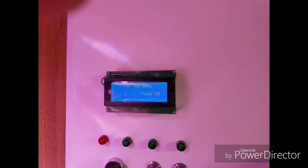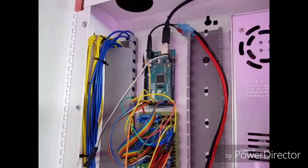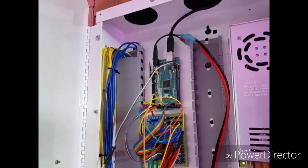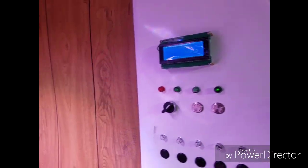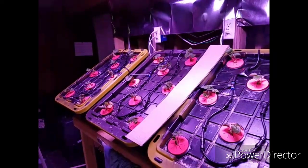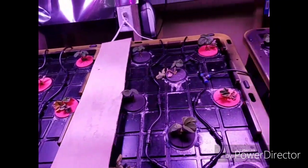Yesterday I had to rearrange this a little bit. I took all the sensors off and I'm going to do a different setup using a few ESP8266s to get all the temperature and water temperature readings, instead of doing it on that Arduino Mega, because it seems like it doesn't like that and it stalls out sometimes.